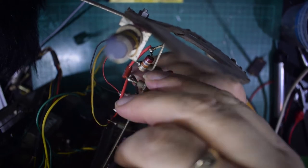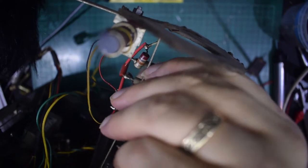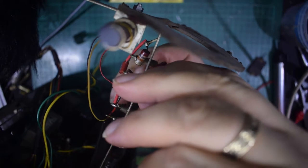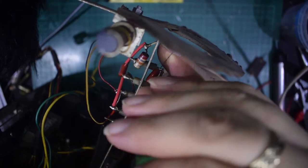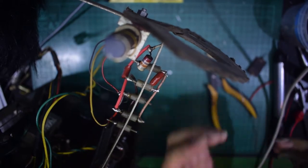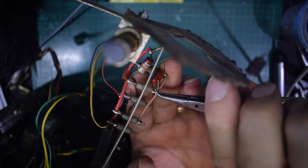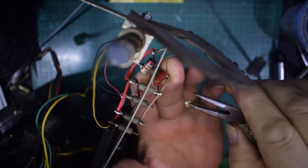That's the thing with modern capacitors — they are generally a lot smaller, and it's one of the reasons why getting spares is getting harder for these sets, because unless you're prepared to try and make modern parts fit, the original size parts are getting very hard to get hold of. You could go and buy a load of old stock capacitors, but then are they going to be as bad as the ones you're taking off? That's the thing you've got to think about.